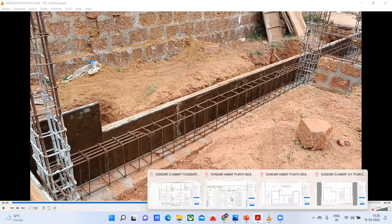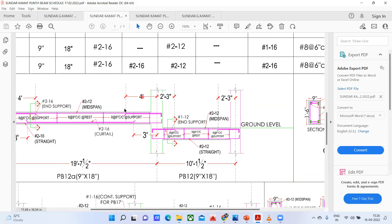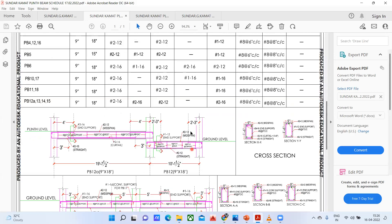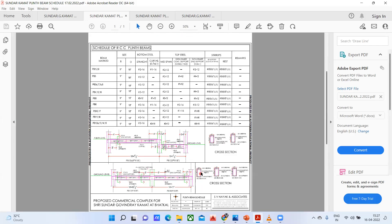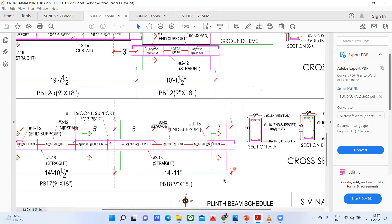Usually if you're lucky, they're going to give you everything — like here they've given from here to here it is 4 feet, from here to here it is 4 feet, from here you leave 3 feet, from here you leave 3 feet, and then you give this curtailment bar. In case they don't mention it, use the formulas I've given — you can do the calculation on site. Because sometimes all those things will not be given, so we should be in a position to understand that.